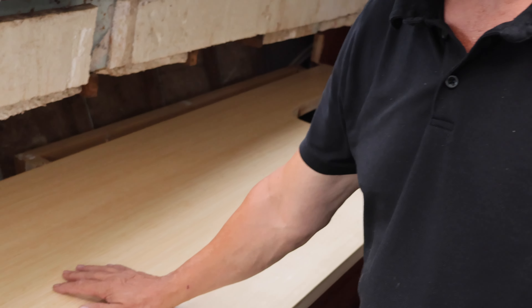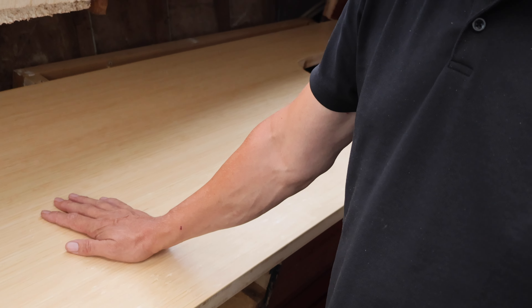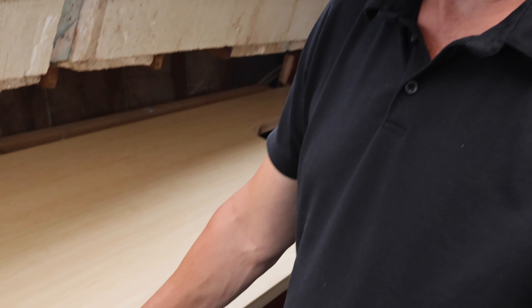It's 6:30 at night and my lacquer feels completely dry. I'm going to sand it again with 280-grit sandpaper on my brand-new sanding machine, then put on the second coat of lacquer so it can cure overnight. I'll do one or two more layers tomorrow, then put in the sink and tap — and I'll have a working kitchen again.